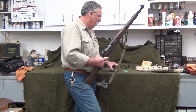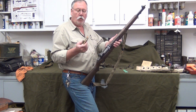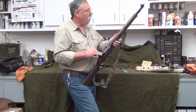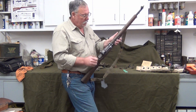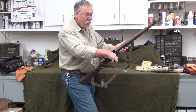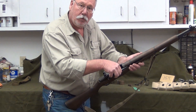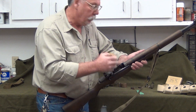The other thing I've noticed is people don't load the clip correctly. The rifle doesn't care whether the last round is on the right or the left — it just doesn't. However, this is old school, and in the old days they designed it for right-hand shooters, not left-hand shooters. The receiver has no relief on the left-hand side for your thumb like you would use on a bolt gun with a stripper clip. So you really only have this area, and you use your thumb to insert the clip. That's why you want the last round on the right, so it's over here where your thumb can work with it.